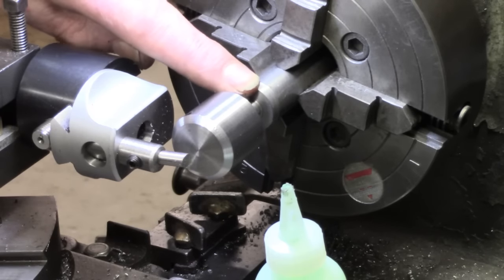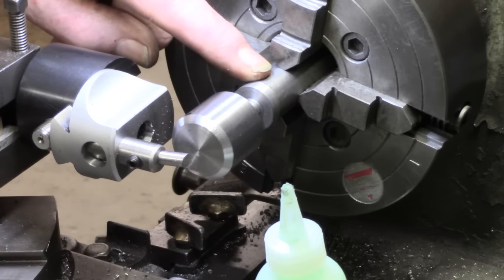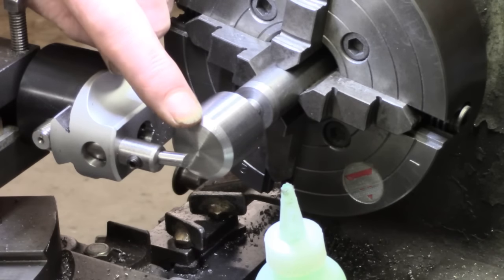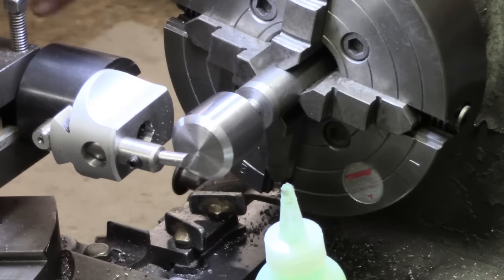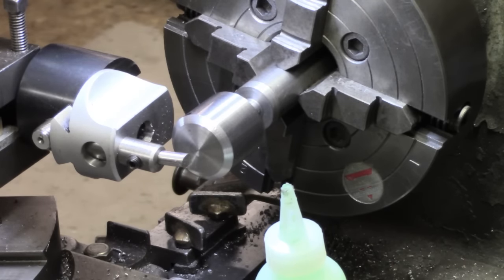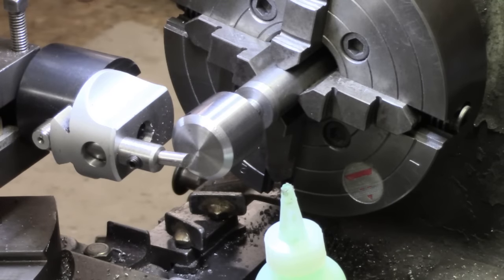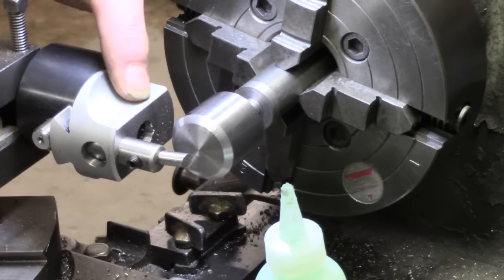Excuse me. I've gone back into the chuck probably by, well, I don't know, I didn't measure, probably an inch or so, something like that, because I think the chatter when I get it on this end is basically due to the difference in rigidity. I've only got a 3/8 threaded stub here, and although this is done up tight on the thread, I think it just makes that slight difference. Also, I'm coming to the conclusion that at this stage anyway, taking a light cut, there's not a lot of point. If I take a harder aggressive cut, it seems to be better for chatter. But anyway, this is still an experiment, I suppose, because I'm using the boring head adjustment.